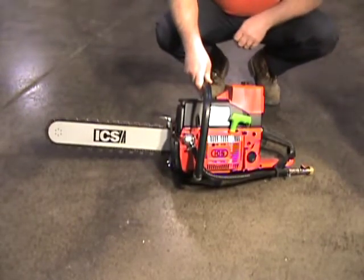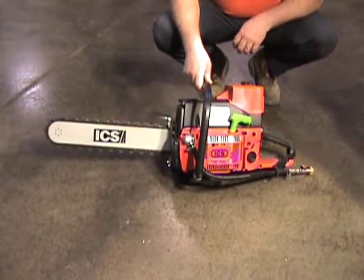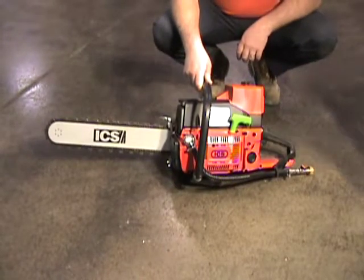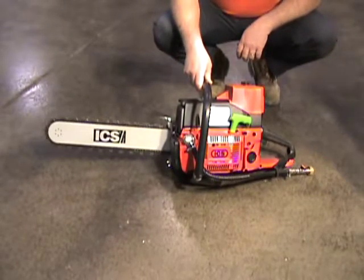and you can't cut with the Mr. Manhole cutter. So you might be able to score a groove down a couple inches and then take this saw out and plunge cut and go right around that circle, and you'll end up with a nice cut. It cuts 16 inches deep. It's running on gas.